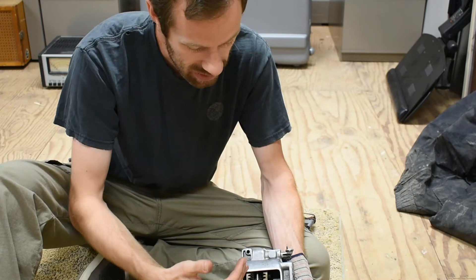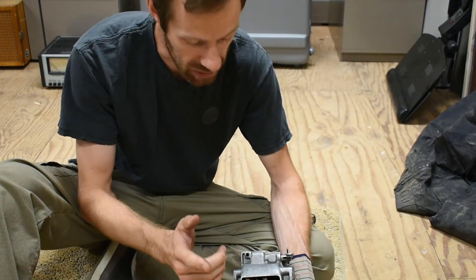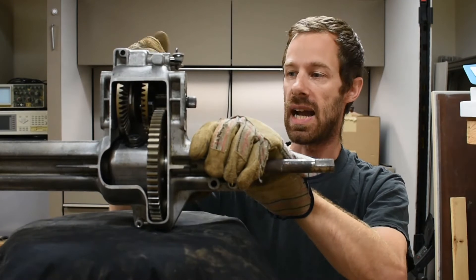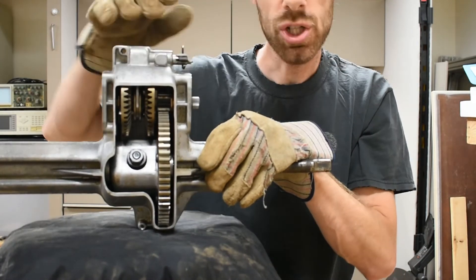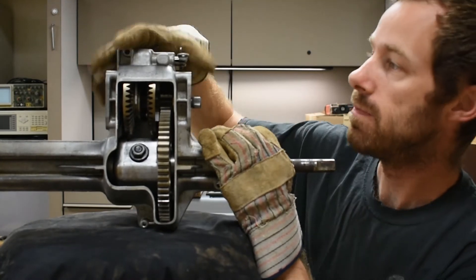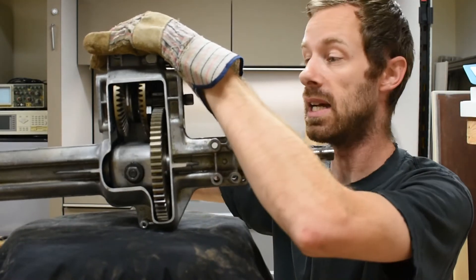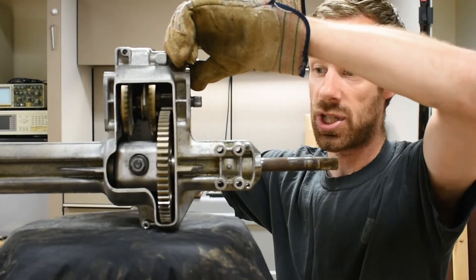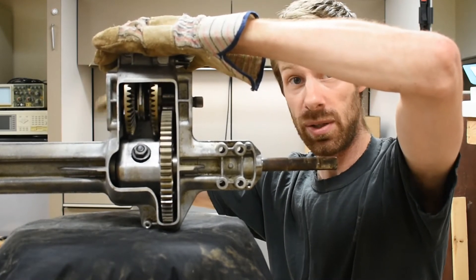Now we're all reassembled and we can see the gears shown through the top of the transmission. Let's take a look at what happens when we start spinning the original input axle that comes from the engine and see what happens with the gears inside while we begin shifting it. As the engine spins, it spins a pulley attached to the axle on the back, and it causes the bevel gear inside to make the two bevel gears on the side rotate. Now as the shift lever is moved into the three positions — forward, reverse, and neutral — we can see that in one position it causes the spur gear to rotate in a particular direction. And if we shift it back the other direction, as soon as the motor engages, that spur gear shifts in the opposite direction.